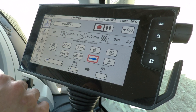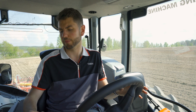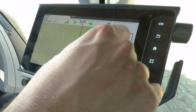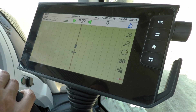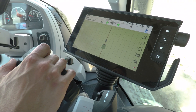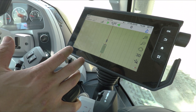When I lift up the machine it will stop. If you want, you can have multiple triggers — for example, you could add auto guidance as well, and then both things would need to be active for it to colour in. Once you've done that, go to your map page. Turn on the auto guidance, drop the machine down, and voila — it's already painting in behind me. Lift up the machine and it stops painting.